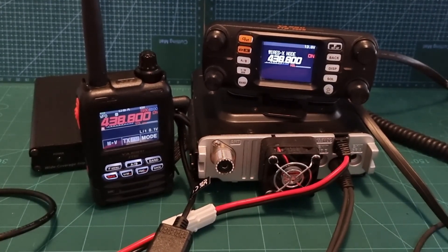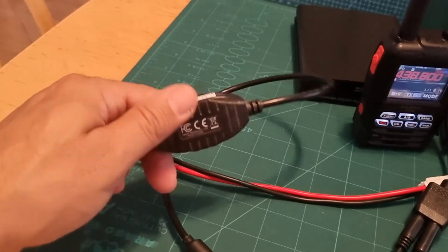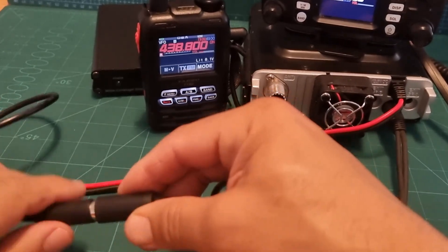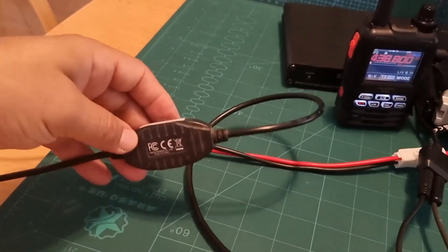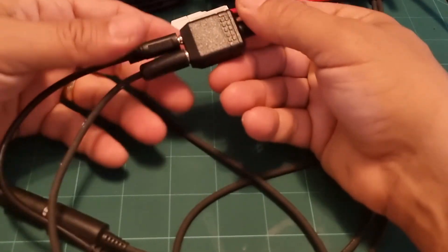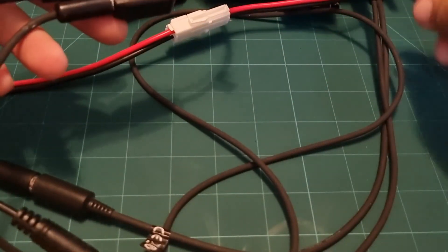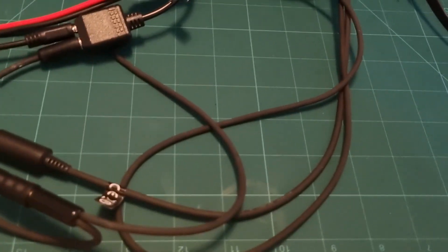To recap the connections: you've got the SCU 20 cable plugged into the PC - that's the SCU 20, SCU 40 kit, or SCU 58 - going to your PC. Then you've got the additional SCU 40 kit piece, which is a 10-pin plug that connects to the USB cable. This 10-pin adds the kit functionality - super important because this adds the analog FM part to your setup, with another 10-pin plug going into your FTM 300, FTM 400, or FTM 100.